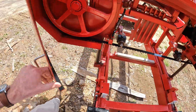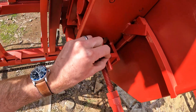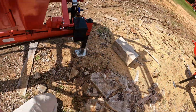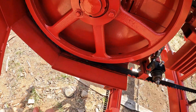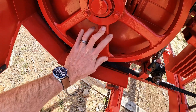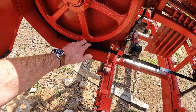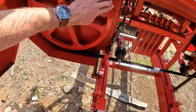Another thing that has a big role in tracking is our tension. So I'm going to put that new blade on there and make sure that tension is set. When we increase tension on a blade, that does bring the blade further out on the band wheels. That blade will come out with more tension and ride back with less tension. So I've got to make sure that tension is right. If my tension is fluctuating, it's going to be real hard to keep that blade true. So the tension and the crown location — that is what is affecting my tracking.